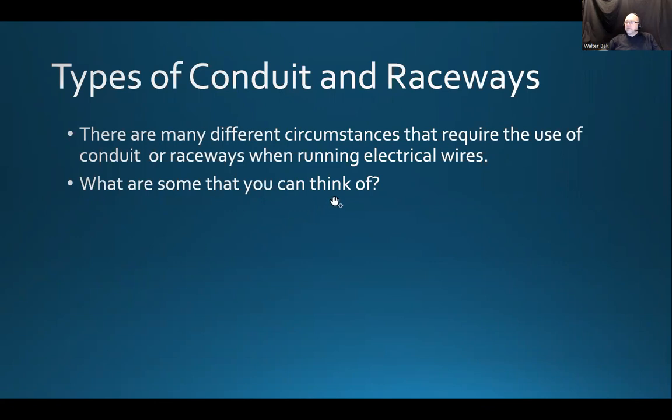If you have, for example, that's an extreme example, if you are dealing with a steel framing instead of timber framing or wood framing, then you can't run those wires just on the surface mount, or you can't mount it to the surface of the inside framing, because it's steel and it's supposed to be non-metallic. But even though it's non-metallic, it's okay if you run a metallic conduit, and you can run it in there. All right.